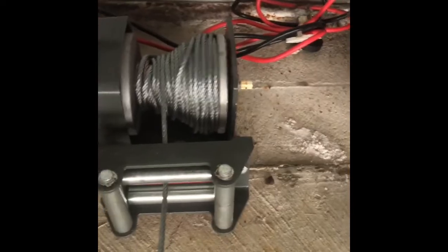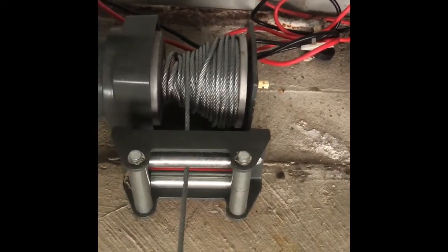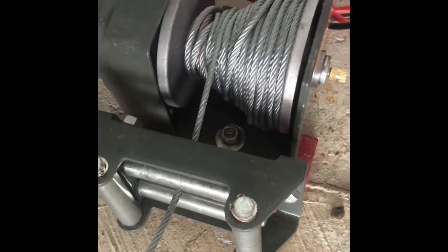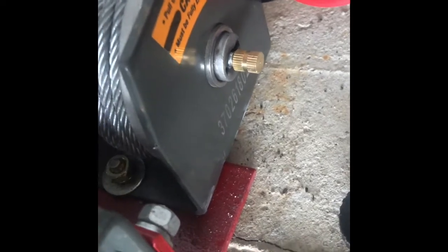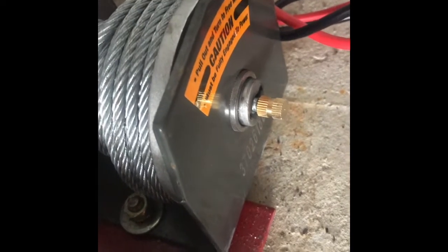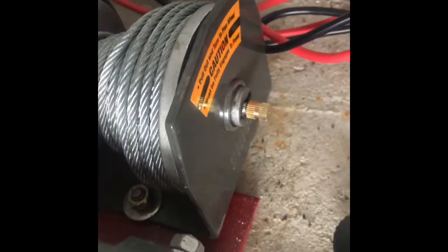Now we've got a problem where the plane is all the way inside the hangar but the winch drew most of the coils to one side, probably because I wasn't quite properly lined up. Then I tried to pull out the knob and the cap just came off, and now I'm having a hard time pulling it out to release tension so I can back some line off the winch and disconnect the line. I've tried pliers and a screwdriver. Note to self: don't pull it all the way in against the blocks — leave it maybe a foot off so you can disengage the hook.